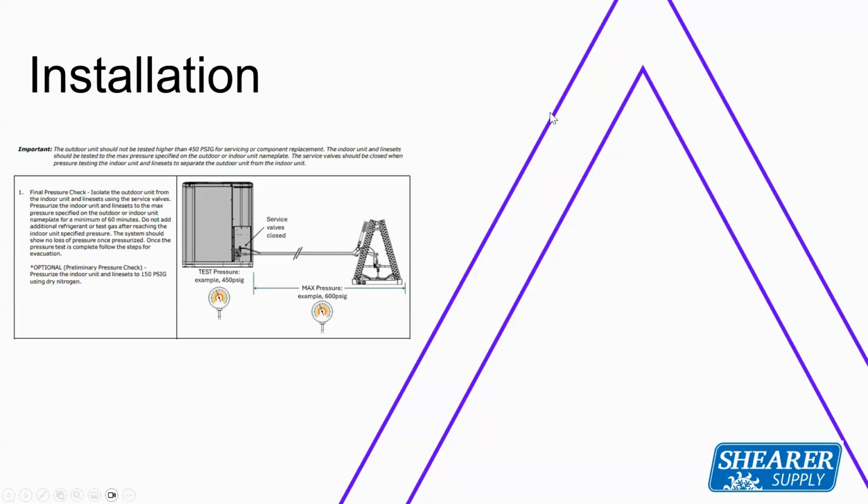Will the BK jumper be needed on any of these indoor units? My recommendation is, if you're using one of the true variable speed units from American Standard, where let's say it's the 5TEM6, the 5TEMC air handler, or even the 5TAMX air handler, or if you're using the S8V2 or the S9V2, those are true variable speed indoor fans.